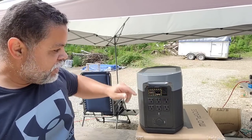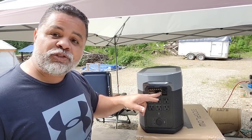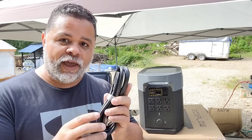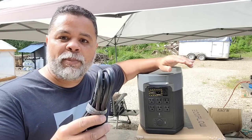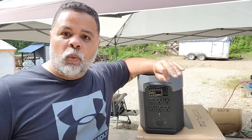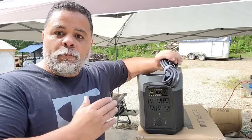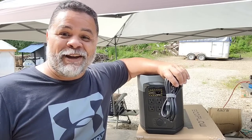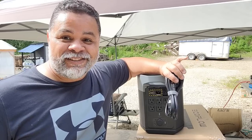Now this is your input. The input is pretty nice because if you're fast charging it using the UPS function, this comes with a cord — not a power block — which is the way all solar generators nowadays should be, because that means it charges a lot faster. This machine will charge at 1,800 watts from your wall outlet, and I really like that they made it 1,800 watts because your garden-variety outlet in any house is at a minimum 15 amps, which is 1,800 watts. If someone were to use a 20-amp charging rate on a 15-amp outlet, it can trip their breaker or, worst case, cause a fire if too much amperage is drawn through a wire not rated for it. So keeping it at 1,800 watts maximum from a wall outlet is a great idea from a safety perspective.